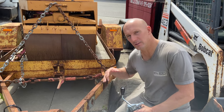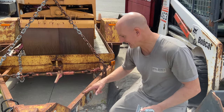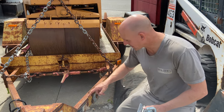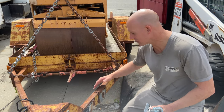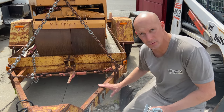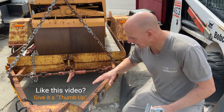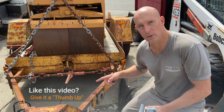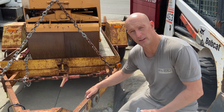In order to install it I'm going to have to weld it, but I can't weld it yet because I have to remove the old plate first. So what I'm going to do is separate that from the trailer, remove it, grind it down, and sand it down to bare metal so that I can weld the new jack onto the trailer. First thing I do is grab my grinder and start grinding.